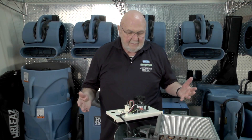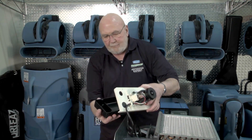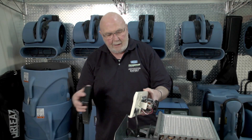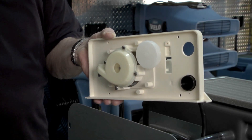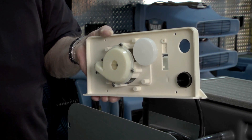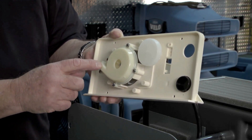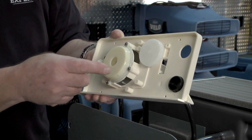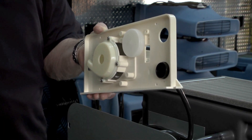You can determine the cleaning frequency through use — sometimes it's every job, sometimes it's every six months to a year. I pull the basin off, inspect it, and just use clean water to flush it out. This is the bottom of the float switch — occasionally it will get stuck in the bottom of the pan, which will keep the float switch from working. You also need to inspect the volute, which is the impeller cover. You don't want the gasket bulging around there. If that's the case, it's either frozen or you've gotten chemicals into the pump and it has deteriorated — you need to replace the pump.